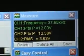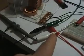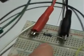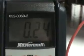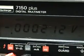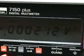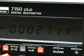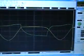I'll post the scope shot of that with the test. Now the leads are connected, charging the capacitor bank into the 1K ohm load. The voltage we're picking up is 0.24 volts, and the current is still going backwards. There's a very slight retune — once I connected the load it was at about 206 to 208, and I was able to slightly retune up to about 212.